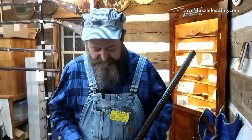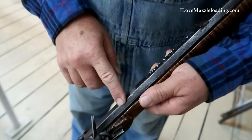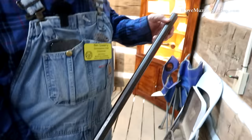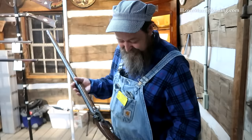This is the gun that I made for Brent Steele, who had the original barrel, and he's not fired it yet. You can see how old the barrel is. The sights were originally here, and they hammered lead into that dovetail so you wouldn't catch your hand on it, and then put the dovetail up here. I had to make the back sight — the only thing it had on it was the silver front sight. The front sight dovetail was cut for the repositioned rear sight, and I filled in the spot where the original sight was missing. Based on what's on the barrel, this is at least the third gun the barrel has made. Hopefully it lasts.